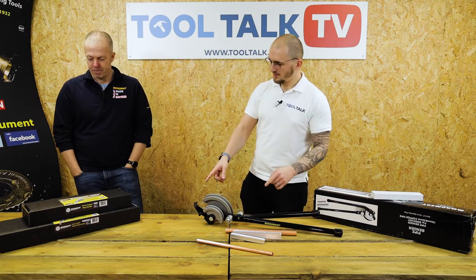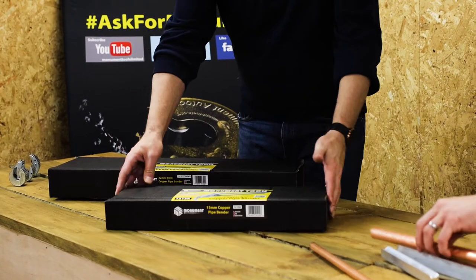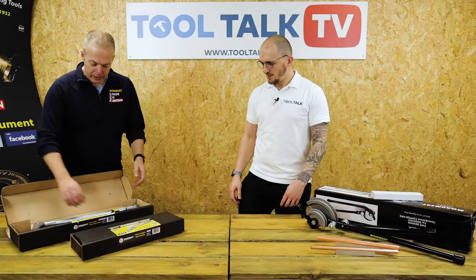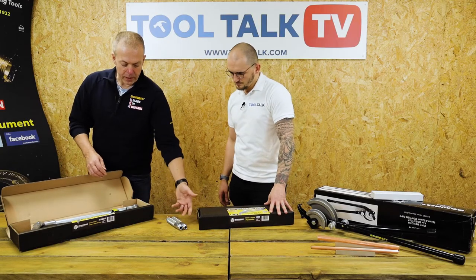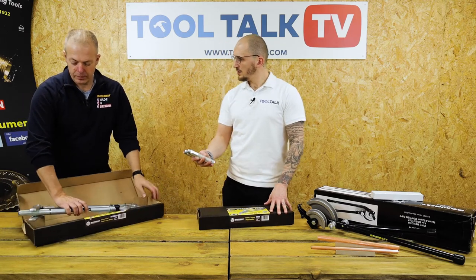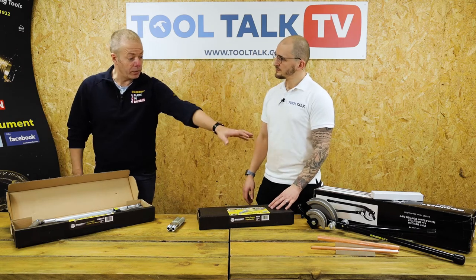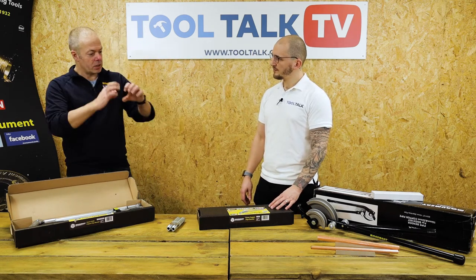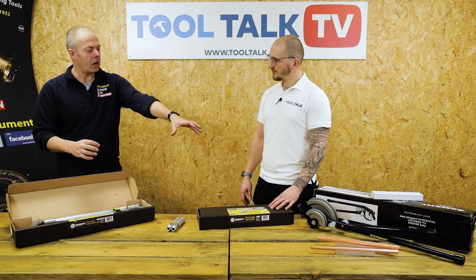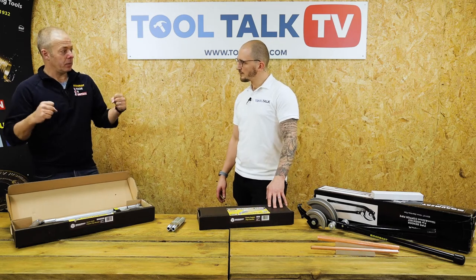So let's move on to this. We've got a 15mm version for the UK and then there's a 22mm version for the UK as well. And if we look at the 22, you can buy them with or without extension handles. When you're bending 15mm, whether it's with one of these new single sized ones or the combi, it's relatively easy because it's obviously a smaller diameter pipe. When you're bending 22, it's actually quite hard.